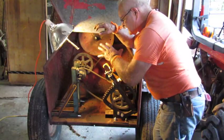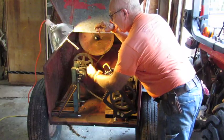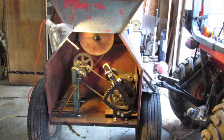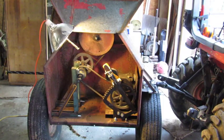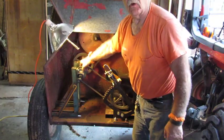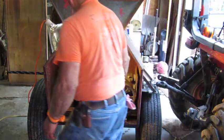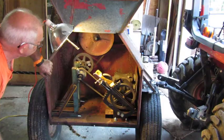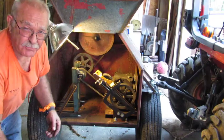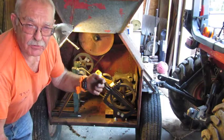Okay guys, I'm going to go ahead and fire it up. I went ahead and greased all the bearings, greased all the way around the perimeter of the drive gear, and we're in the unloaded position right here. The pulleys are a little bit rusty so it should grab and rotate, but there's still no load condition. Let's take a look and see what happens. This is no load, so any amount of weight in the drum — it's not going to rotate whenever I start it in the no-load condition. So far so good, everything looks good. I've got a mark on it right here where I'm going to be able to count the rotation. I'm going to run this up to wide open throttle, make sure nothing comes apart, and then set my timer and count the rotation. My target is roughly 22 RPM as per all the calculations.